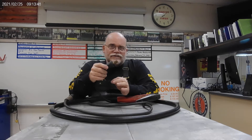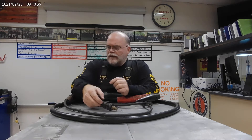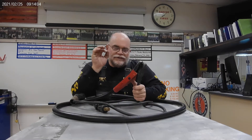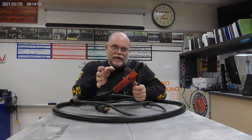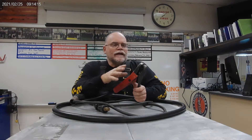It is fed through a standard constant current welder — the kind of welder you would use for stick or TIG. It also has an inlet for compressed air. What it's designed specifically to do is to remove weld and metal, not add weld and metal. That's why it's referred to as a cutting and gouging torch.